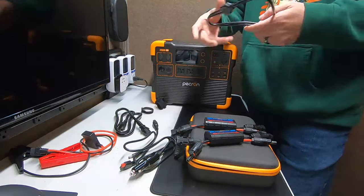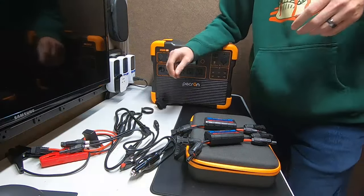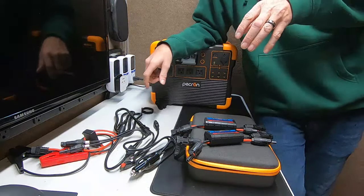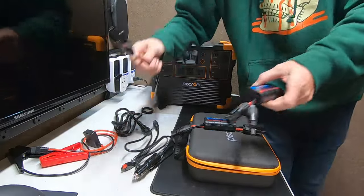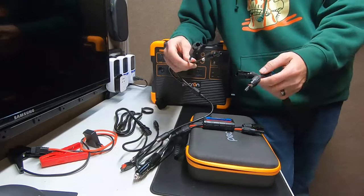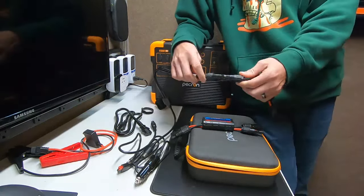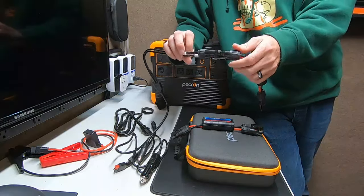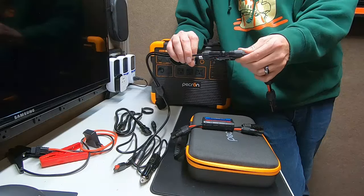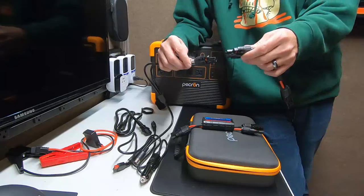You could start a fire. What about reverse polarity? Well, reverse polarity is what I just explained. Regular polarity is the polarity that you have designed to use for your system. As you see, as we put this, that's negative and this is positive. So that means the correct polarity. Reverse polarity just means that these ports are accidentally the wrong way.